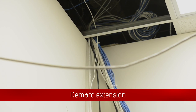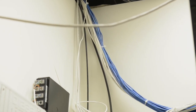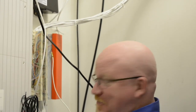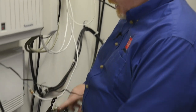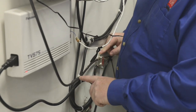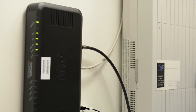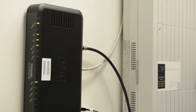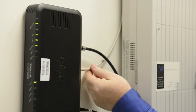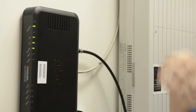Welcome back to my equipment room. This big cable on the right is the one we just saw at the DMARC — it's coming down here in my equipment room and running along down here. It goes through some splitters because we use this for television as well as our internet, and this connector right here comes up and connects into my cable modem. We couldn't bring my network to the DMARC, so we extended the DMARC to my network. That's why this box — which is not my property — is the DMARC extension. This piece of ethernet cable right here I own, so this is really where the separation takes place.